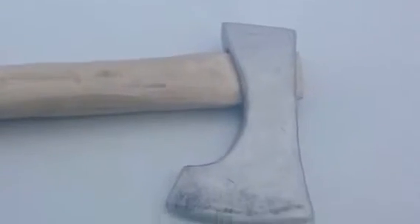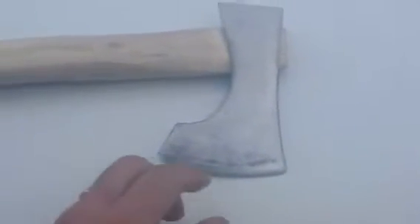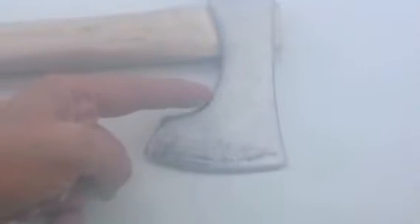So it was a regular hatchet, just a regular cheap $10 hatchet. At the head, it used to come down a little bit more and then it came over this way. So what I did was I drew the shape that I wanted and I took my angle grinder and I cut in — I wish I could remember the guy's video that I watched. I cut into the line and then I took the cutting wheel, same cutting wheel, and I chopped them off and then I used the flat grinder wheel to shape it and then I used flat sanders to kind of smooth it out.